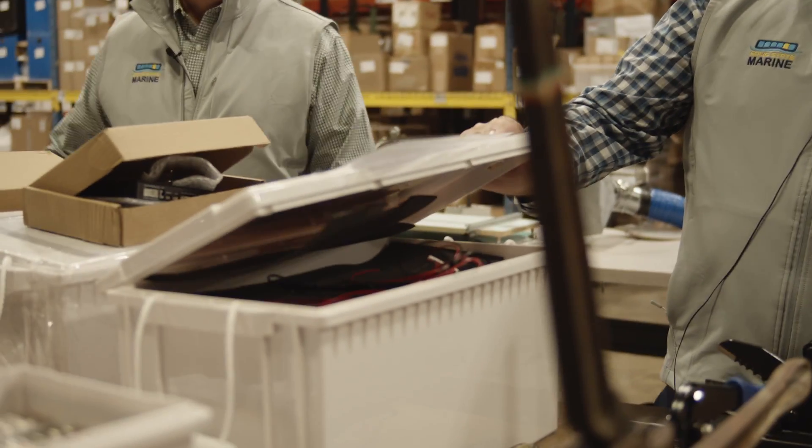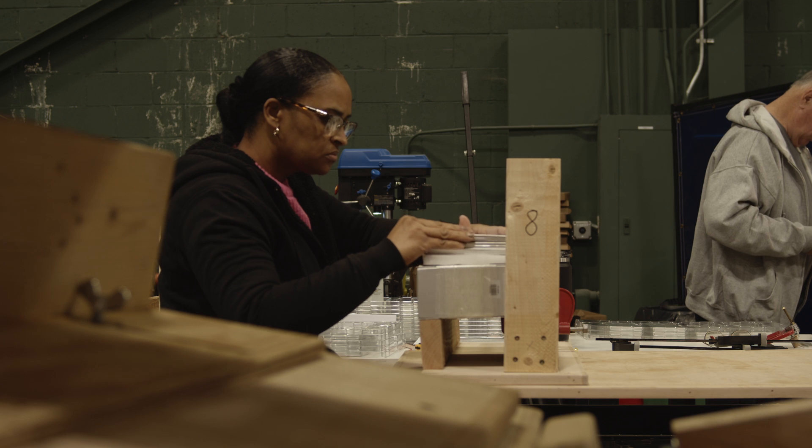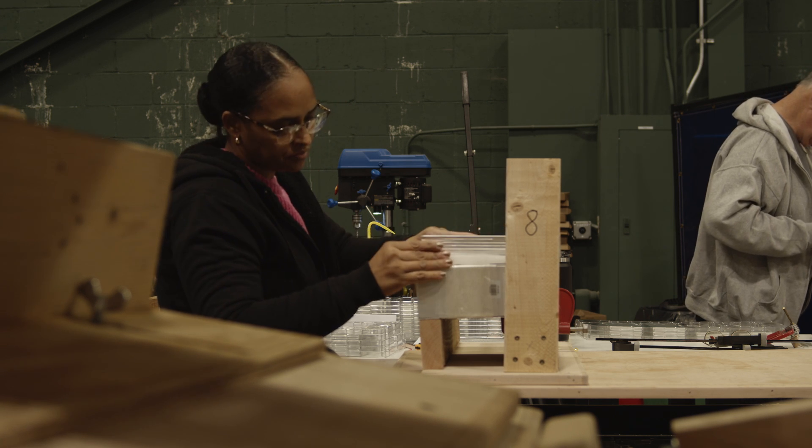From here it goes to wiring. This is the beginning wiring for all of the cell balancing. We make sure our batteries are balanced right from cell manufacturing, but also if during discharge or charge anything comes a little bit out of balance, we have live balancing that happens within our battery management system to keep everything right within the tolerance we want.